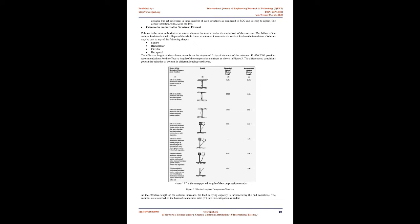Moreover, the cracks formed over RCC structures are wide and deep whereas minute and shallow cracks are formed in the ferrocement structures. Structural members of ferrocement remain free of voids and capillaries, hence remain corrosion resistant and waterproof due to these properties. Ferrocement has high strength to weight ratio. Ferrocement is thin section high strength structural material, highly waterproof, crack formation resistant, energy absorbing material.